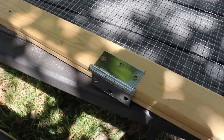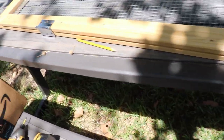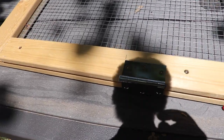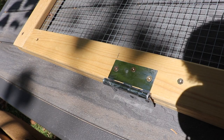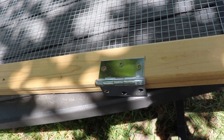I've got the door made and the next thing is to put the hinges on. I've made them about 14 inches from the top and bottom of the door. I went ahead and used the inch-and-a-quarter screws — they're a little bit longer and sturdier than the screws that came with the hinges. Next I'm going to mount the door on the coop.